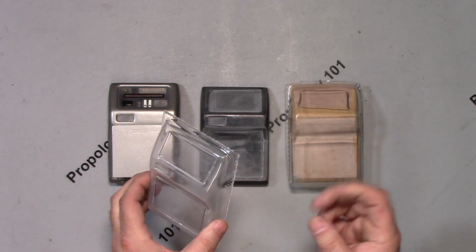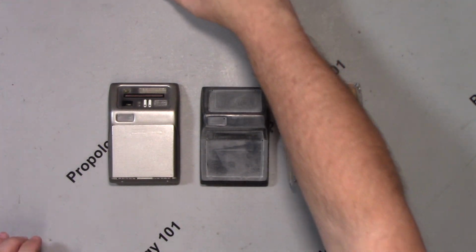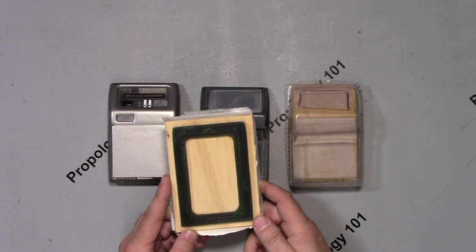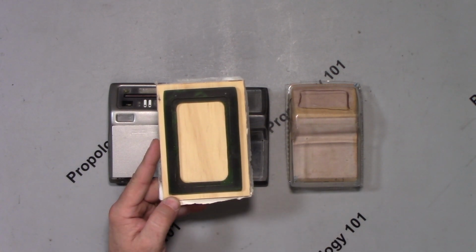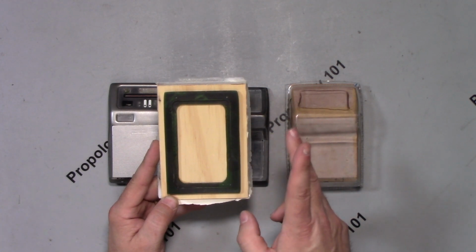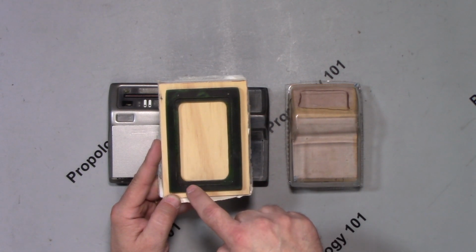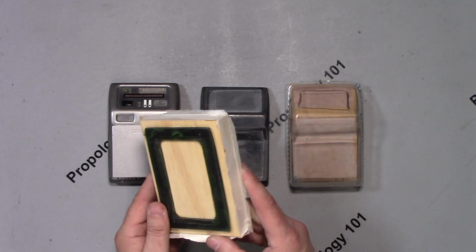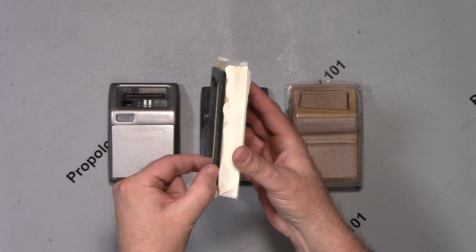And then we thought about, we need a door for the bottom of this to hold everything in. And here is this. This is the original acrylic piece that we had made to be the door for the bottom of this. And this is cast, meaning that you would mold this and cast a copy of this, and that casting would get glued into the bottom of that. This is actually 2 sheets of acrylic that are 1/8 inch thick.